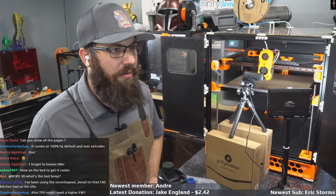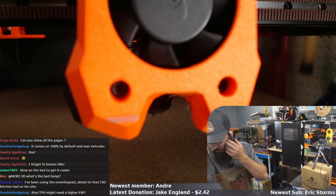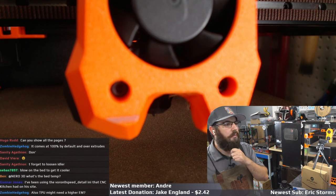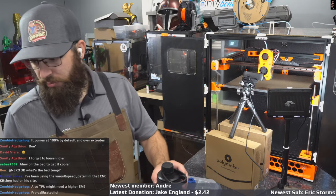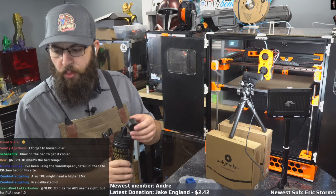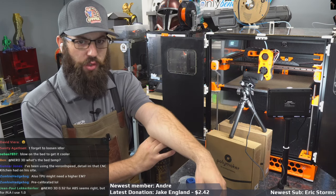So I might be under extruding. Yeah, whatever. Pushing molten plastic out of a glorified hot glue gun. Good enough. Higher EM. What the heck's EM? Oh, extrusion multiplier. The Rat Rig profile has it at 0.89. I'm sure it'll be fine. 0.92 is for ABS. This PLA profile is based on the ABS profile. All I did was drop the temps and up the fan. So that's why the PLA profile is 0.92.